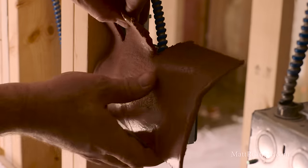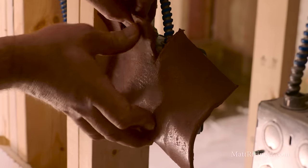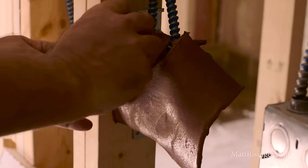Once the green glue is installed and we've got our double layers of 5/8" drywall, we also need to treat other penetrations — things like outlets or wall switches. Every box needs to be puttied in with a clay pad that adheres to the back of the junction box, covers all the holes, and actually adds some sound insulation to the metal box itself.